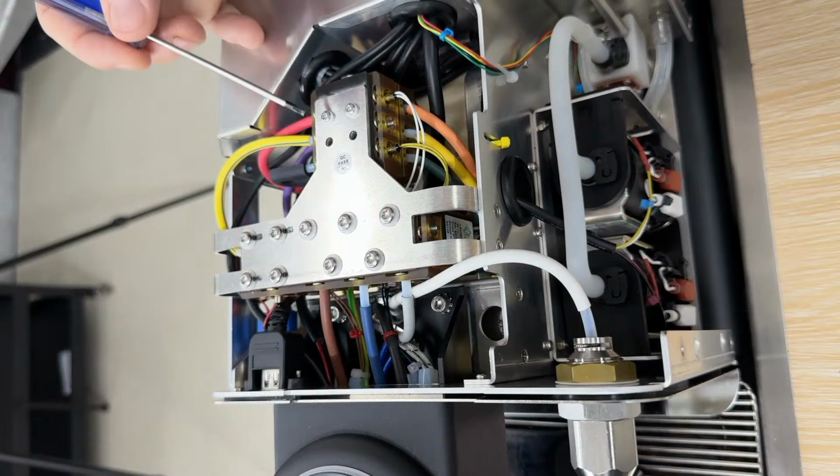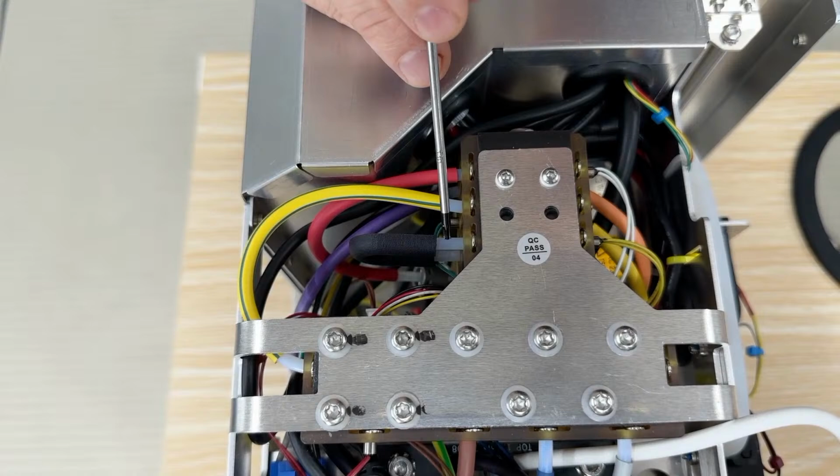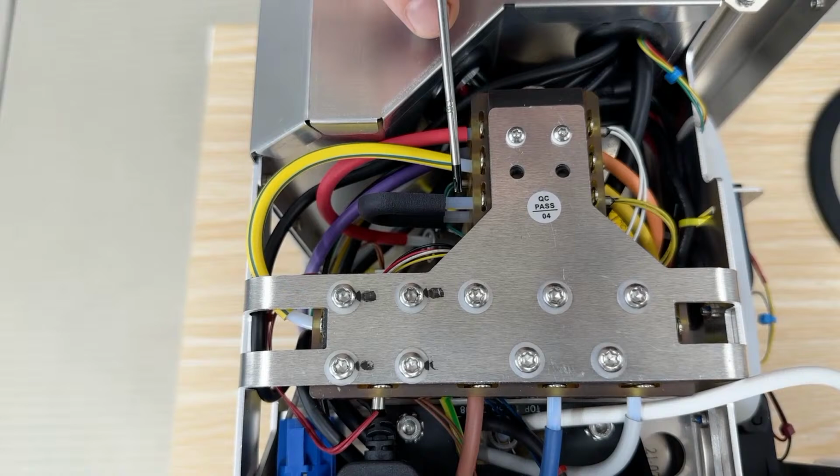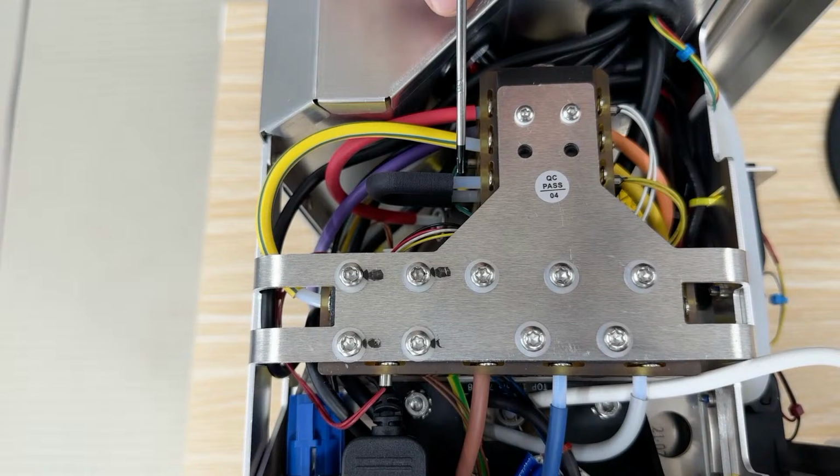You'll also notice, if we come back here, that the color of these tubes is kind of a cloudy white. Now these are solid Teflon. They're not Teflon coated. Nothing inside the water path is coated because coatings tend to come off, especially as things go hot and cold. This is considered the absolute top end. And in the latest top end machines out of Italy, the Pro machines, you will see a bit of this as people move away from the solid metal tubing to solid Teflon.